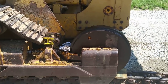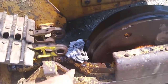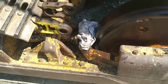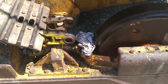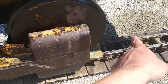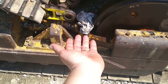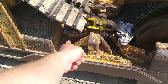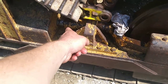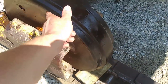I've cleaned up most of my tools — I just need one ratchet to put the plate back on top. I left my rag sitting on top of the grease fitting so I don't get dirt down in there. I flipped the idler assembly over from last time and just rolled that idler right on the track — it rolled real nice. I lifted up the cylinder and shaft as I rolled it in there, and it just sets in place. Nothing holds the thing together — it's just going to be tension once we put the track on. I shoved a piece of board in there to keep the idler from rolling back out.